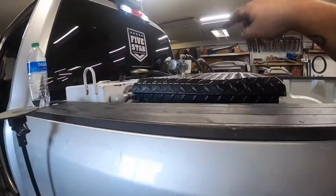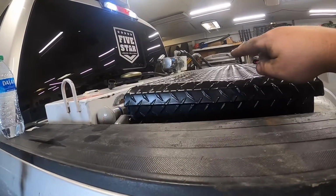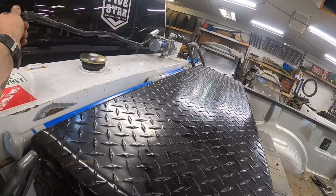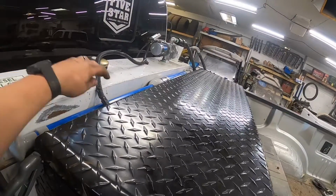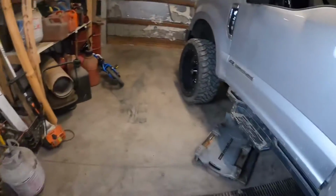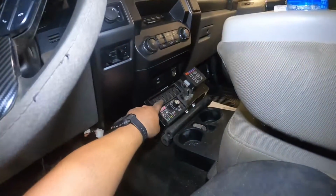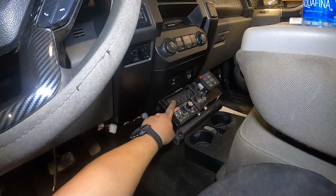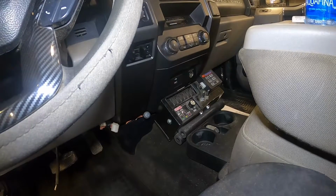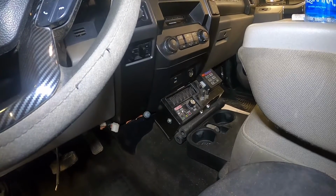Oh, also, so if anybody wants to complain, there is 3 fuses on this pump. So you can see up there my extension right here. You see the little fuse end about a little over halfway down. So there's a fuse on it right there. Each one of these switches has a 15 amp fuse, plus they're backed up with another inline fuse for whatever it's powering.